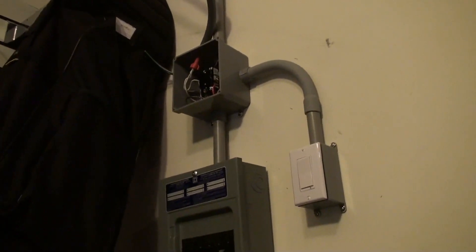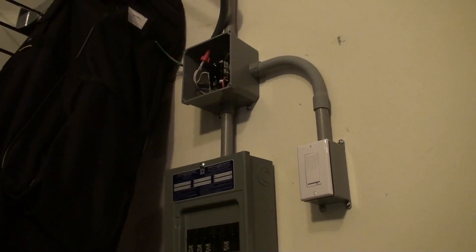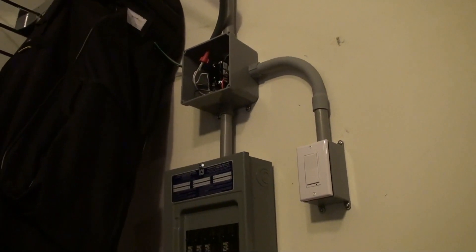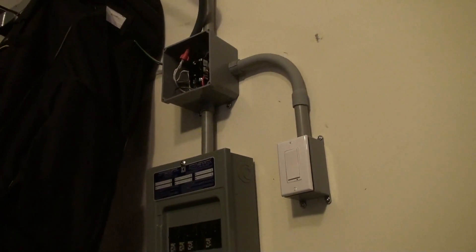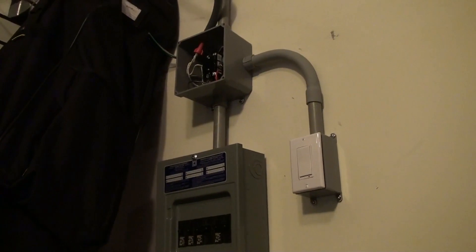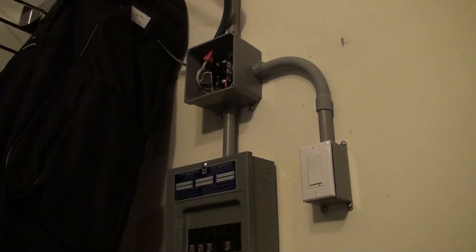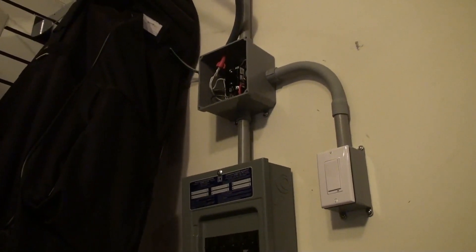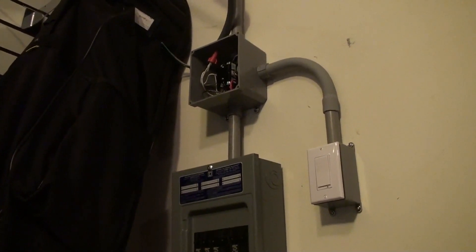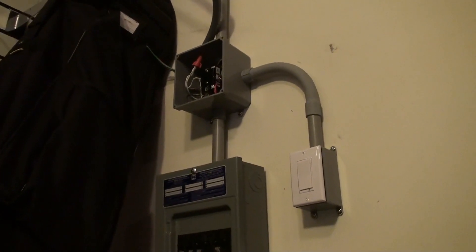There's going to be one disadvantage to this setup. Using this contactor will turn off the fan as well as the unit. Ideally I'd run a second contactor to keep the fan on after the unit goes off. I looked at doing another contactor and a time delay switch, but I ended up in a situation where I'd spend another $100 trying to get a $70 heater to work. So we're going to give it a shot and see what happens. I only plan on running it on the 3000 watt setting.